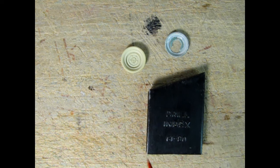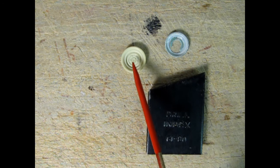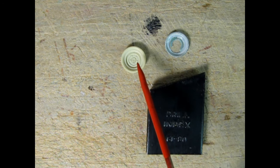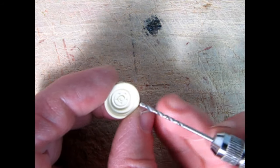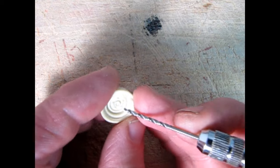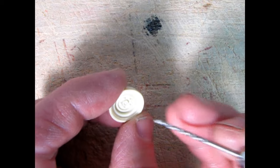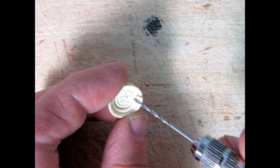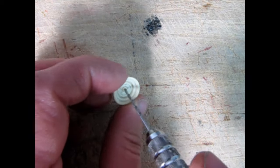The reason why I want to drill a hole into the rim is because we're going to be using this wheel to get the size of that center post for our tire changing machine. And that center post will go through the center of the rim just like it does in the real world, so we need to open up that hole in order for that to happen. It's easier to choose the back wheel for this because in the front wheel the center hub goes through and there is a grease cap on the end of the center hub for the main bearing. But in the back these just bolt right to the rear axle.